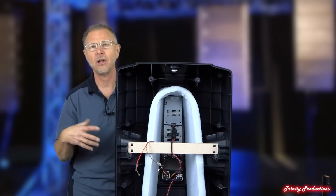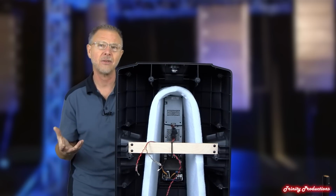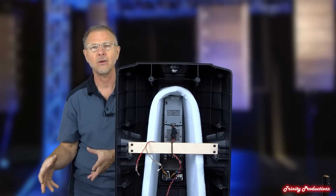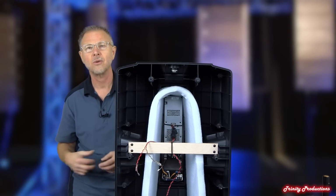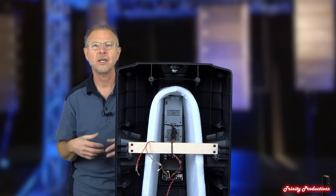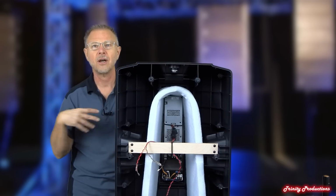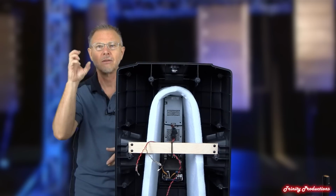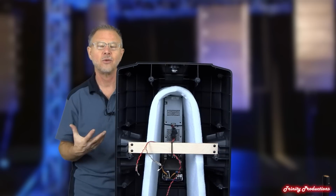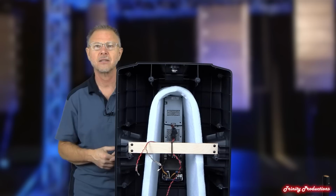It's pretty much the same on all of the ART series, using kind of the same series of amplifier on all of these 7 series, being 700 watts RMS, 500 going to the low frequency driver, 200 watts going to the high frequency driver. Depending on the size of the driver, they are limiting the power, so even though it's 200 watts, you're not going to be worried about blowing this little driver. They do a real good job with peak limiting and RMS limiting on these boxes.